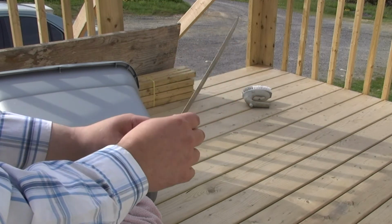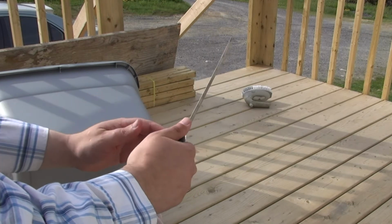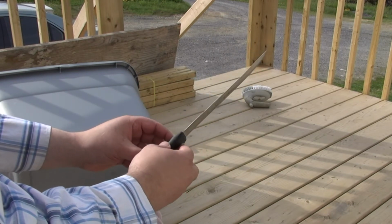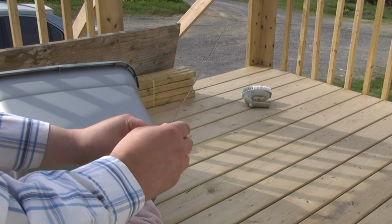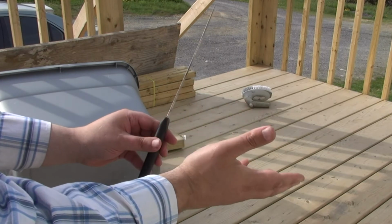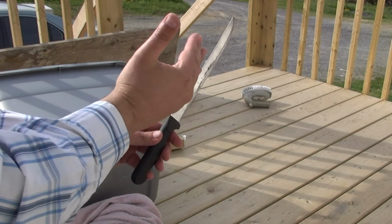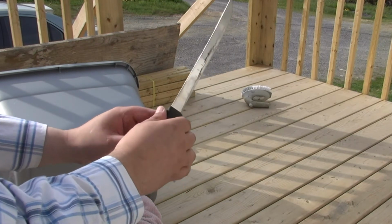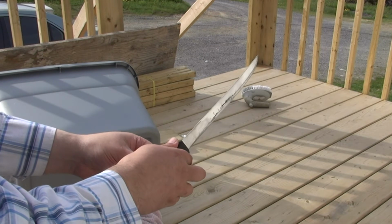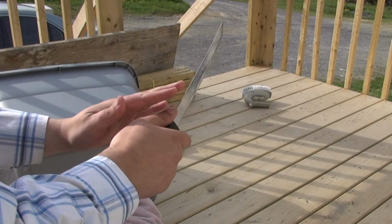The blade was left extremely square on the spine, so it's really not comfortable in any respect to try to hold on to. And the blade stock is so thin, and the blade itself heat treated so far less than optimal, that the blade will actually twist and warp. Even if you try to cut a potato, the blade will bend.